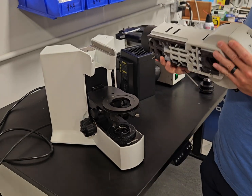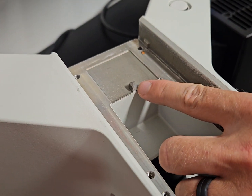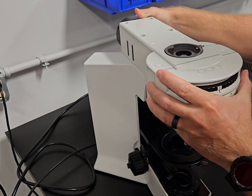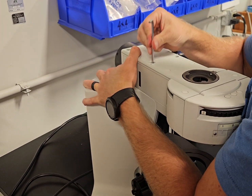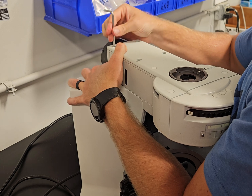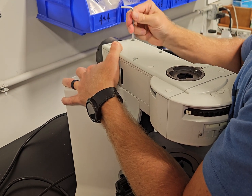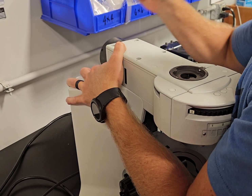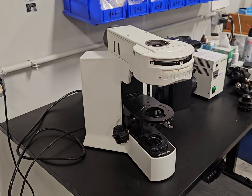All right, they're all off. What's really important about this is you have this little notch right here — kind of like a slant — and there's this little triangle here. So when you put this illuminator on, you want to push and slide it on, make sure everything's level, and before you start tightening, push back into the left. I kind of push my chest into it — then it's like tightening a tire when you change a tire: just snug up each screw. Don't tighten one down tighter than the others; get them all started while pushing back into the left, then tighten them down in an X pattern. That's why Olympus put that little triangle there — so it's a preset.